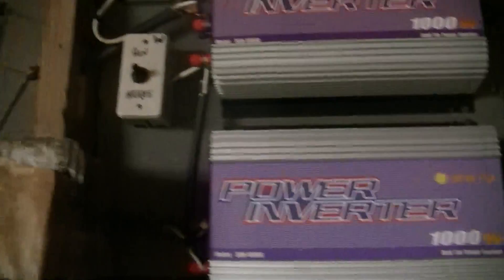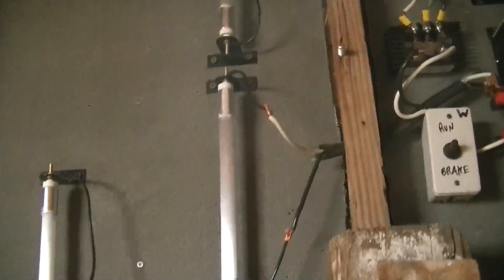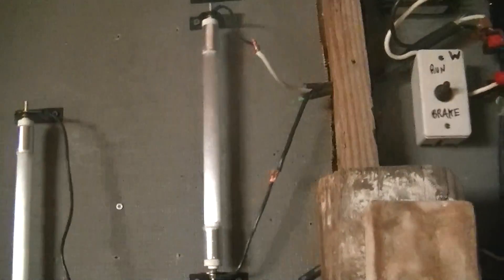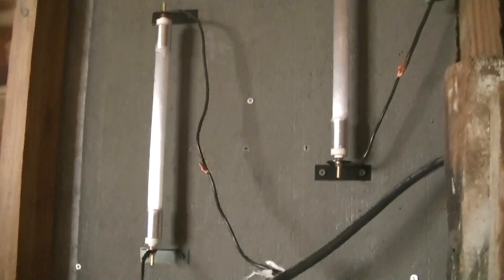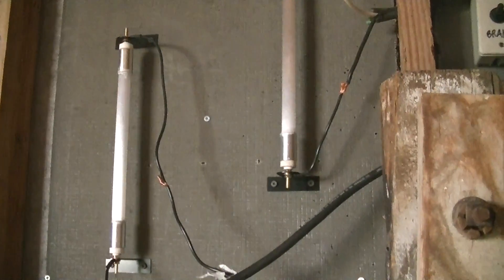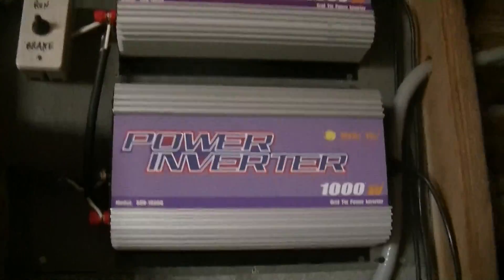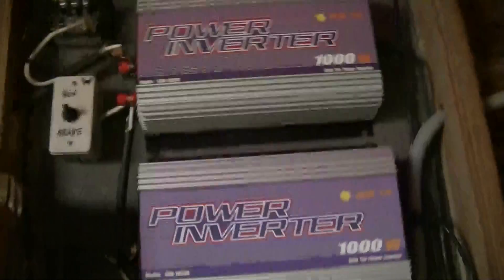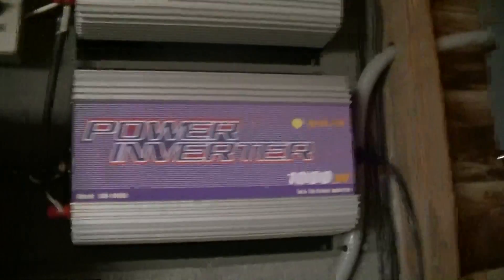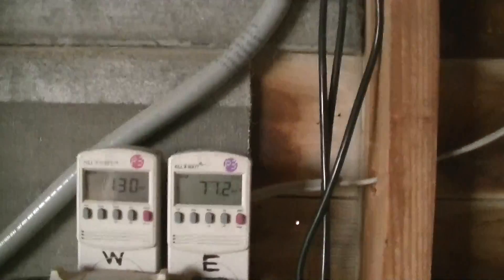I am looking to see if I can control this bad boy a little bit better with the two GTIs under higher wind conditions. Each one of these GTIs is going to its own dump load here — kind of a crappy wiring job for my testing. These are single dump load coils being sold by a Chinese seller on eBay that appears to be affiliated with Sun G, or at least is claiming to have matched and tested these with the Sun 1000 G inverters.